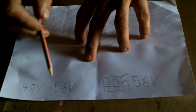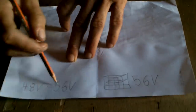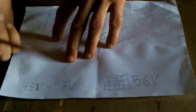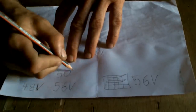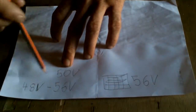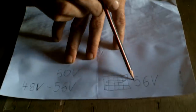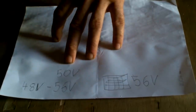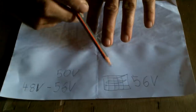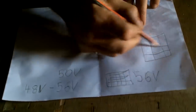My first thought was: I can reduce this, because I'm making the battery banks myself. I leave out a couple cells — I'm using lithium iron phosphate batteries — and get down to like 50 volts, so maybe 40-42 to 50 volts. The maximum voltage is what we're concerned about. Then the 56 volt panels have a 6 volt differential, electricity still flows, and I can charge the batteries to 50 volts.